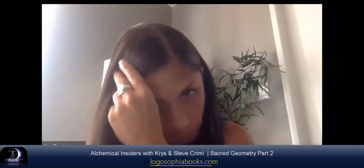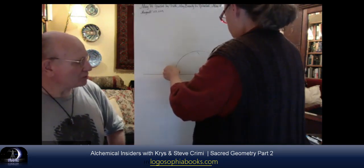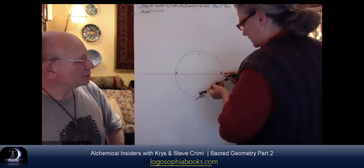I'm going to open up my compass by twirling this wheel and place the point at the juncture of A. That's too much, you're going inside the circle. I'm aiming toward somewhere around that middle point. So you cut above and below. That way you're going to have three points to line up, and it's better to have three points than two, for accuracy. Then you roll to B, get a firm footing. Good. I've got a strike and a strike.